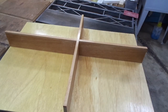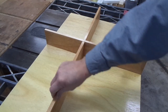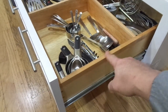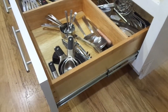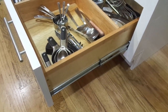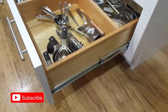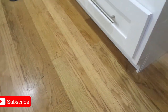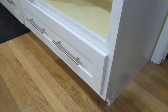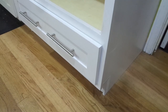The quality of the plywood is not so hot — there's an area that's kind of rough from the outer veneer layer, but there's not a lot I can do about that. It should be relatively easy to clean and will come out of the drawer if needed. The bottom of each drawer is half-inch plywood sitting in a dado and glued all the way around — I've never had a problem constructing a drawer that way. Hope you got something out of it, please like and subscribe, leave a comment, and as always stay safe and keep your eyes out for the next one.